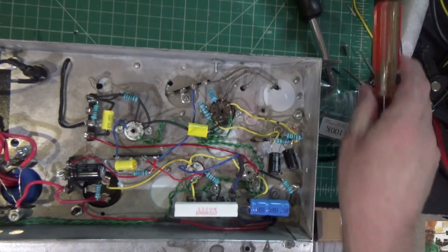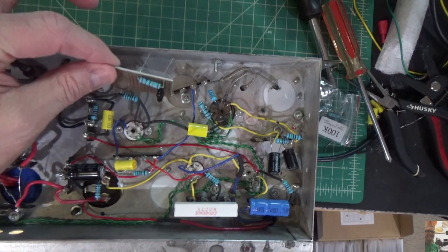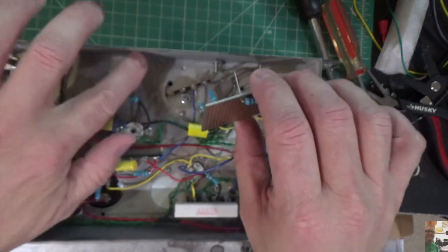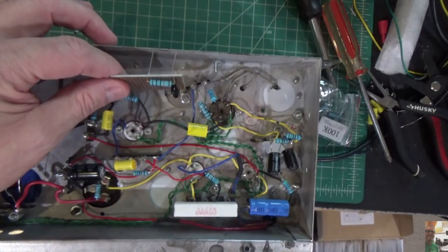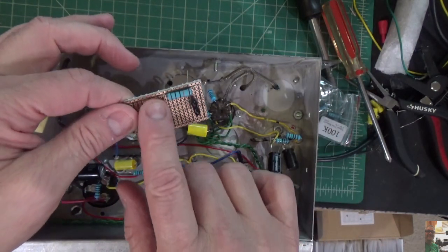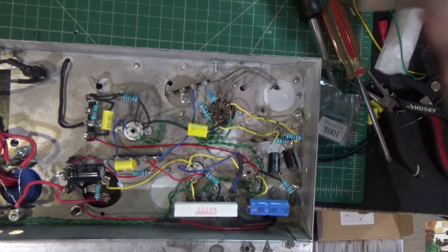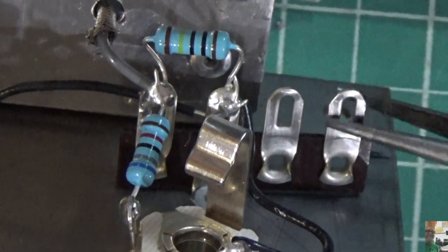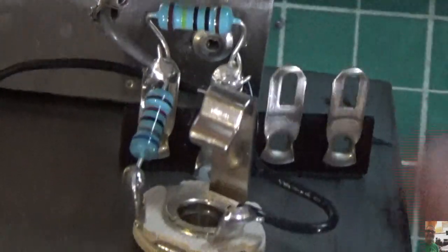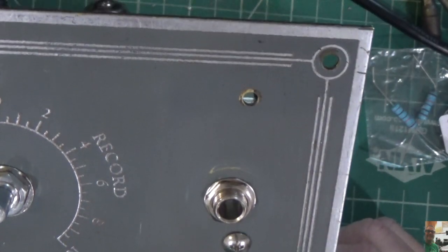I'm going to complete working on that tone section, and then we're going to throw it up on the scope and the dummy load. For this card that I'm going to build, I could mount it here with a metal PC standoff and just bolt it into the back and drill a hole right through here. I also wanted to give you a better view of this terminal strip — this is the terminal strip I installed for the input jack. It just sits back there on the front. I already had a hole drilled here, so I didn't have to drill any new holes. I have it mounted right here, and I actually have another hole right here if I need it.